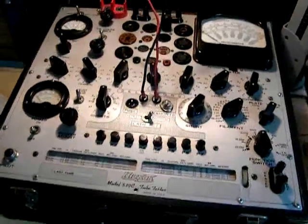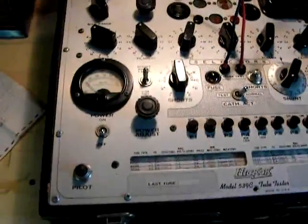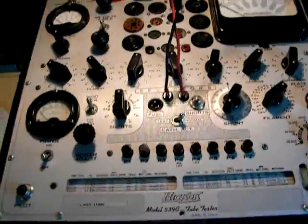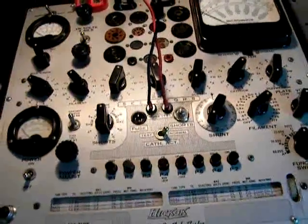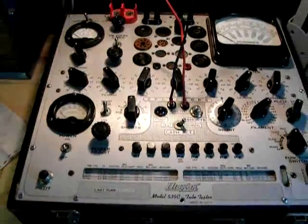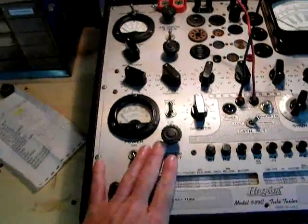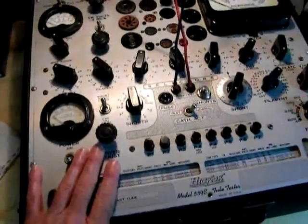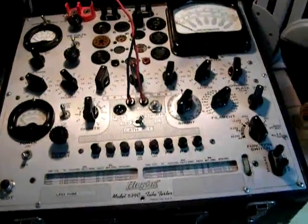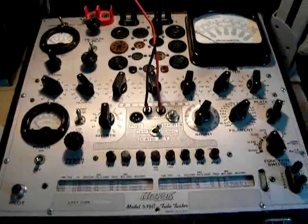What happens is when you turn down that resistor to cut back that power — that wattage — it actually loads up on the board itself in the tube tester. And you may notice some of your old tube testers run kind of warm. I know this one, if you felt the tester after running it for a while, it felt kind of hot. That's undue stress on the tube tester itself.